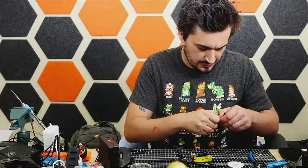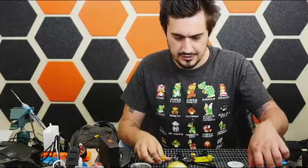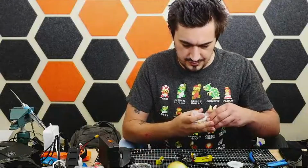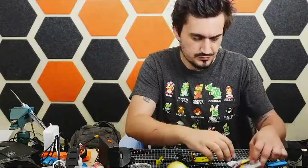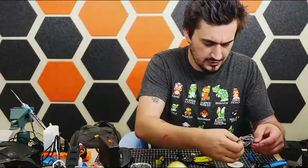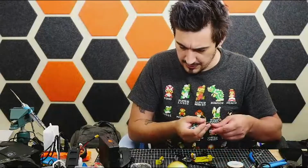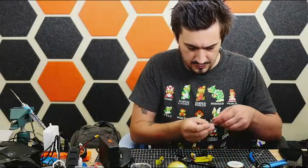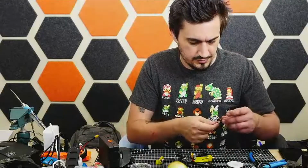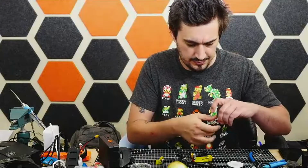These wires have a silicone housing on it. It strips with your fingernails really easily. It's very easy to work with. But it also breaks open really easily too, which can be kind of a nuisance. So when you're moving wires around, it's pretty easy to pinch it and tear open the housing on it, and you can end up with a short that way pretty easily.